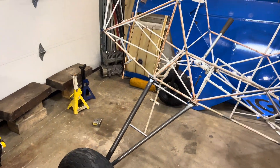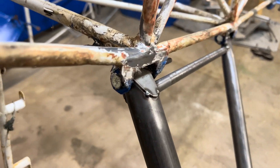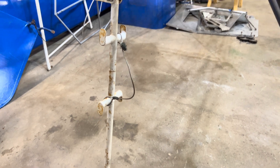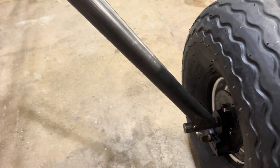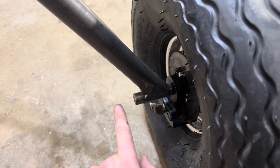One gear leg is just about finished. I've got it all tacked up with the MIG welder. I'm going to go over it with TIG soon, but before I do that I want to figure out how I'm going to get the suspension to work. I'm going to extend this and measure what this gap is here that we've got to fill. I'll have to make some little plates to go in here to reinforce this joint and provide a bolt hole to mount up to this.